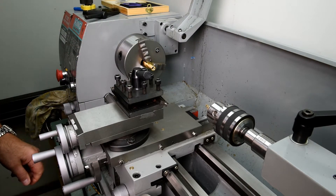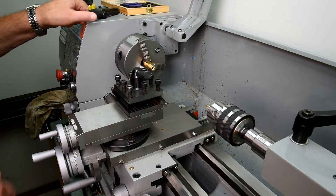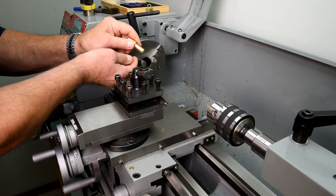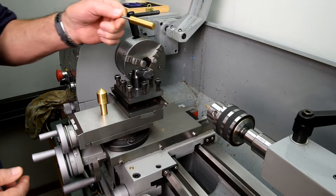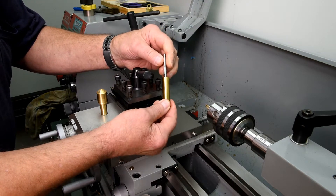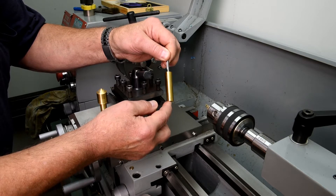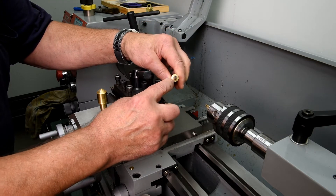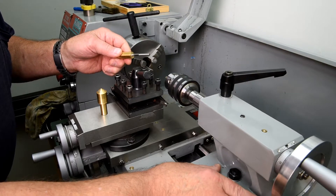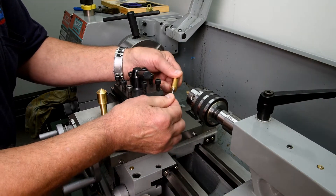Let's have a look at this and see if the taper will match. I better clean that out a little bit first. The reason I'm showing you this - when I was turning the Emperor kit a few months ago, I had to make up my own barrel trimmer shaft because you couldn't buy shafts large enough for those humongous brass tubes. And when I drilled the hole down through it, it went so easy I was moving the tailstock in and out by hand. I just can't figure it out.